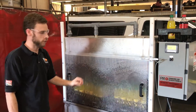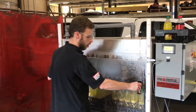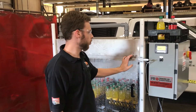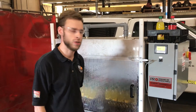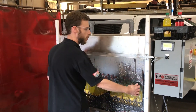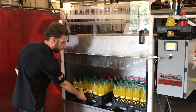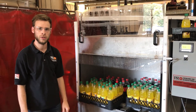There's an automatic shutoff feature — if the door is ever opened while it's in the middle of running, it'll automatically shut off. To start the pasteurizer again, simply press the start button. If you want to stop it before the run is up, press the stop button. Or if it's done pasteurizing, open the door, remove your tray of pasteurized product, and put a new tray of unpasteurized product in and start the process over again.